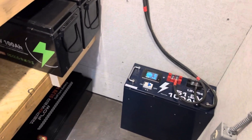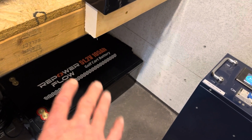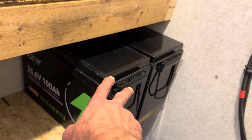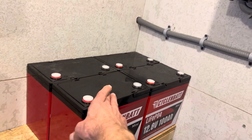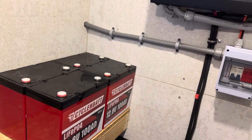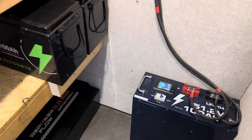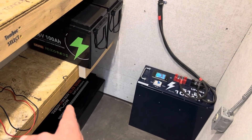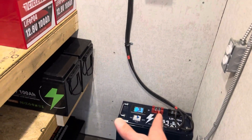Right now I'm running off the Vader server rack battery. I've also got a Repower Flow golf cart battery to hook in — we're going to use a golf cart battery in an off-grid application. Then I've got two 24-volt, 25.6V lithium batteries that I'll series together and bring into the system. And I've got four Cycling Bat low-temp minis — the ones that were $130 on Black Friday — which I bought three more of to make a 51.2-volt pack. I'm showing different battery options because some people want server racks, some like the big golf cart batteries, but as long as it comes out to 16S or 51.2 volts, they all work fine together.